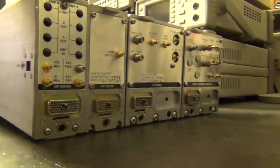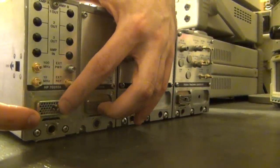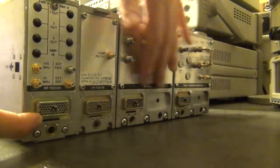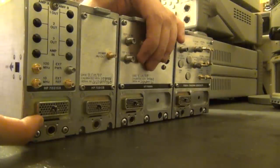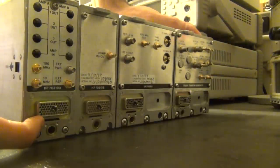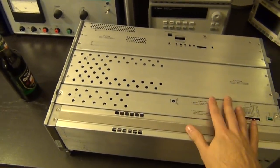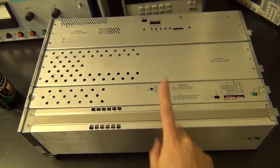At the back you can get an idea of how this thing interfaced with a mainframe. You can see connectors where the power was inserted, with a three-pin alignment section so it doesn't get inserted crooked. This is where the data and power go in — it had a GPIB interface — along with the IF output, the LO sync input so the tracking generator can be phase locked and frequency locked to whatever else is in the system.